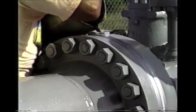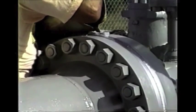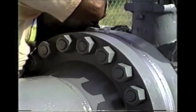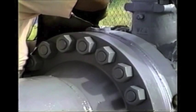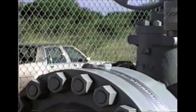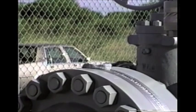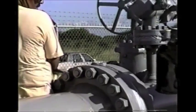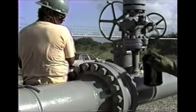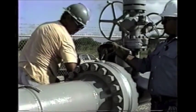This 12-inch flange is going to take about six or seven pounds of wax — about a three-quarter inch gap between the flange faces. Sometimes wind gives us a hard time using the big bucket. If it does, we have a smaller, about a gallon bucket with a funnel spout on it, and that works real good.